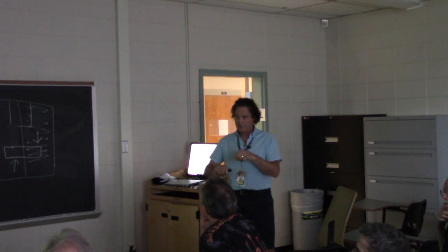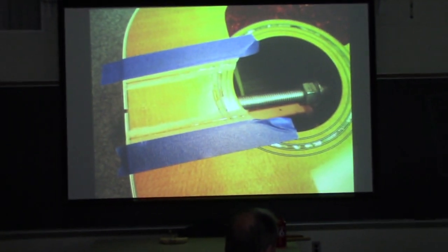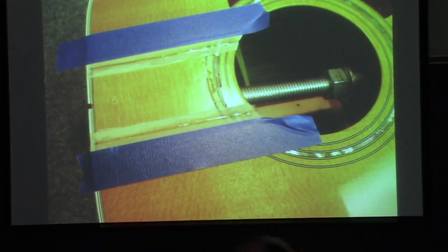And then I draw it up with a pipette, and I just lay it right down in that spot. I leave it there for a minimum of 1 hour. After an hour you look inside and you will see a very thin brown line. It's great because it doesn't do what super glue would do, which is make a big wet mess under there and stain the underside. It's very tight and concise. The heat from your infrared lamp also makes it wick in. Sure, yeah, that will help too.